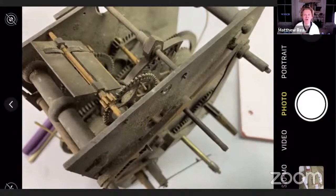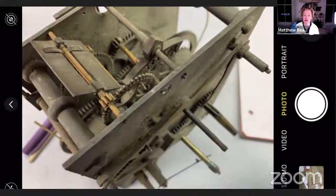You've all been to the old, or remember, the older people amongst us have sat polishing copper kettles and all that stuff. And of course, the problem with that is you polish it and it tarnishes again. You will never win that battle. However, in a regular environment like we experience in a house like this with central heating, there is a state of equilibrium that's reached between the buildup of tarnish and the environment. It's not like steel that if it's rusting, it continues to rust till it's completely used up. So for me, that brown stuff is an absolute gift and I want to preserve that at all costs.